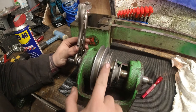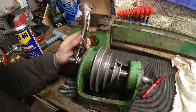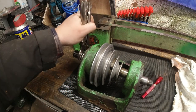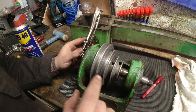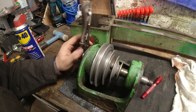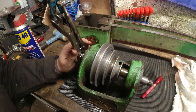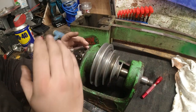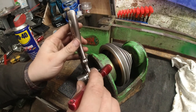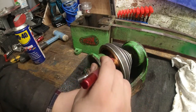I think when this starts to move round, which there's no reason why it shouldn't, I can't see a keyway on this front or rear at all. So the only thing that, for my eyes, is holding this in is the grub screws, and there are no keyways on this at all. So I think what I'm going to have to do is make something that's going to go into here. Maybe just put a bolt in if I've got one, and then try to jiggle this, maybe give it some heat inside this section here, if you can see that. But there is nothing at all.